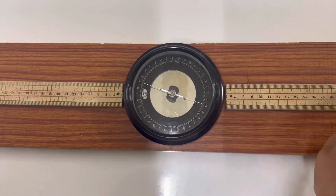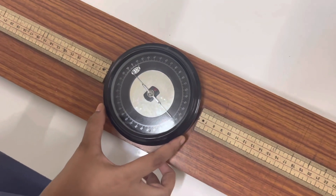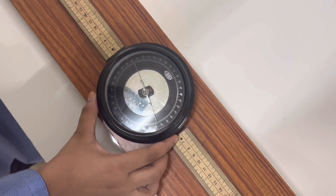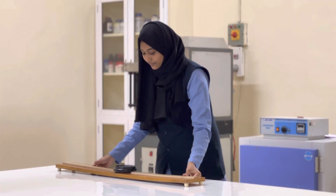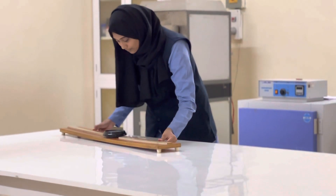For the tan B position, the deflection magnetometer is kept roughly in the north-south direction and the magnet is kept perpendicular to the arm. The 90-90 of the circular scale is kept parallel to the arm, and the apparatus is adjusted to keep the aluminium needle in the 0-0 position. This is our tan B position.